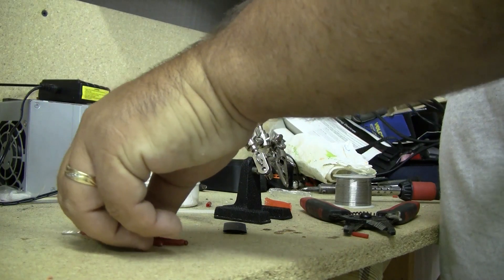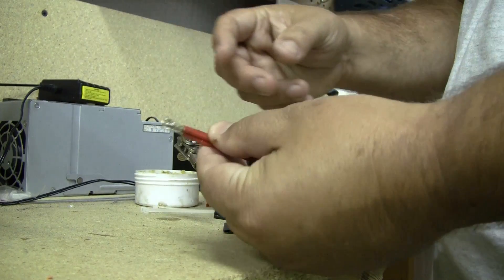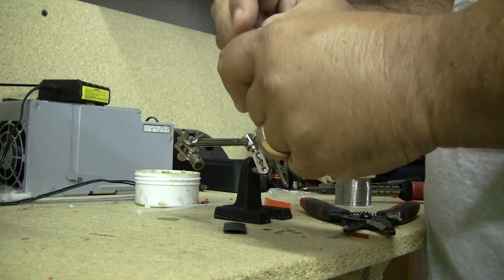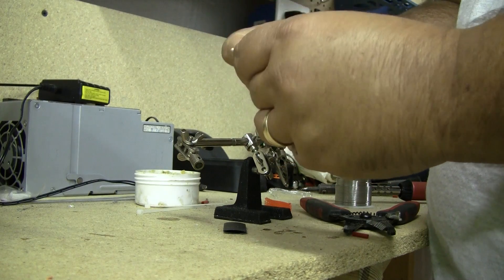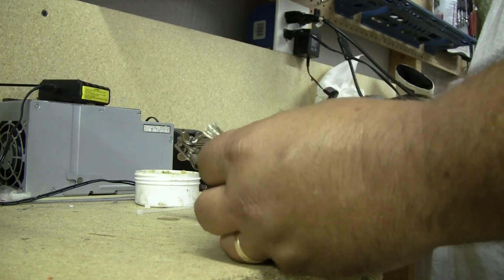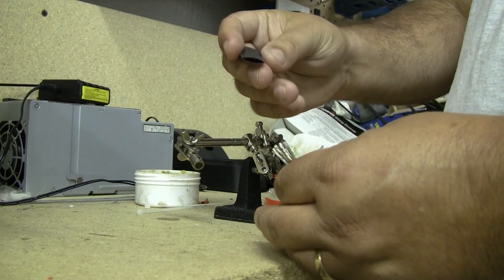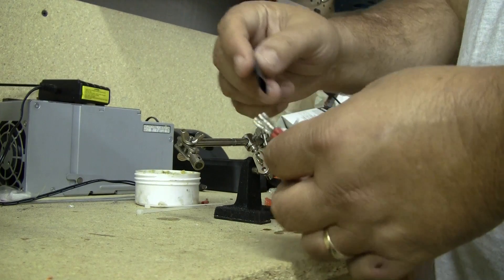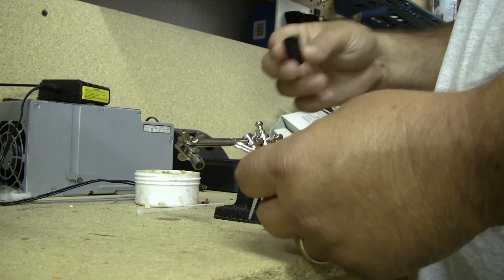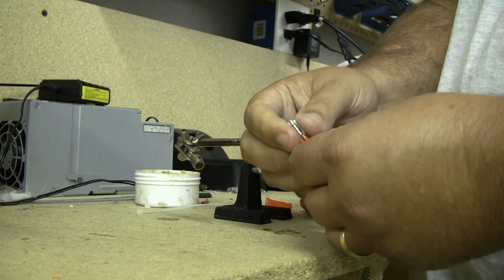What I'll do is take my four ESC cords — these are my simulated ESC cords. Since I've got four, I'm actually going to make a little cube and zip tie them together. We'll be using heat shrink with this, so you've got to make sure you've got the right size heat shrink — this is actually a little bit big but I'll put it on for the simulation. This heat shrink needs to be up on your four wires or your power wire in advance, so don't forget that. I've got those zipped together pretty tight there.